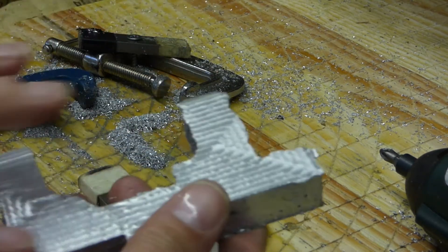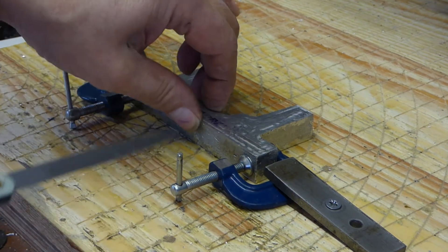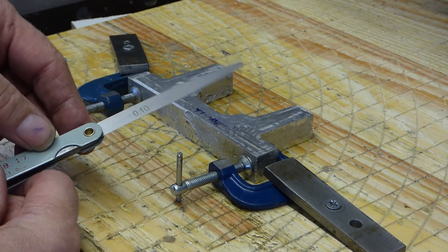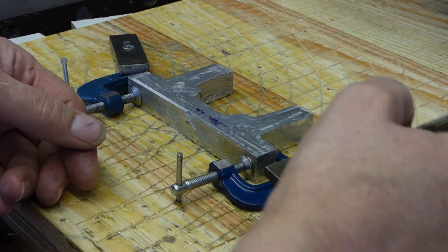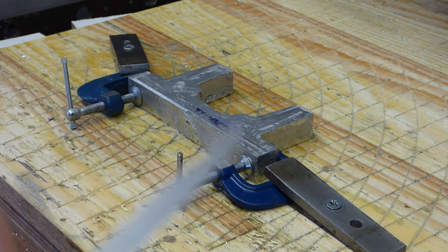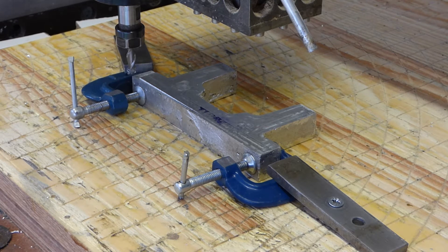I think I like this one better than that one. I think we've got this pretty well clamped down flat — we've got here a 0.1 millimetre feeler gauge, or for you American guys, 4 thou, and it's pretty well flat onto the base. So I think we're good to go. I'm going to take 2 millimetres off the surface and then see how I go from there.